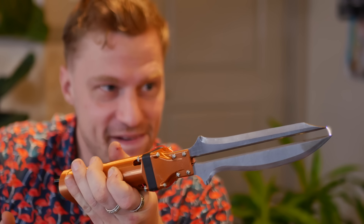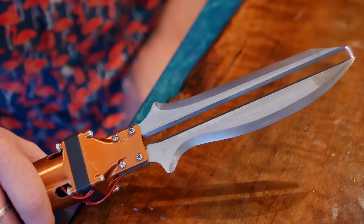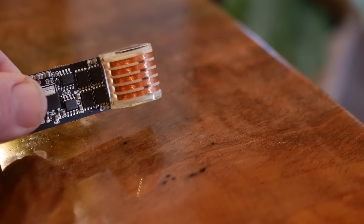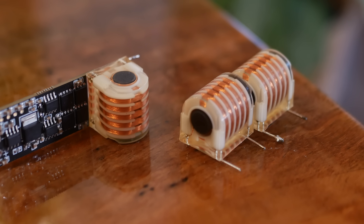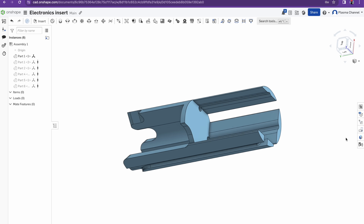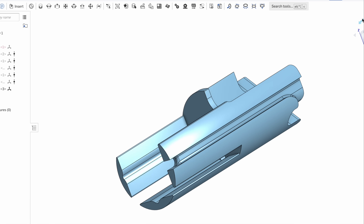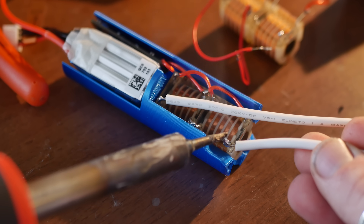I have a little bit of an issue of it forming an arc at the end, but essentially it works. It's a little underpowered, but I think I can fix that. These boards come with one transformer attached — adding a second transformer allows for double voltage. Space was already tight, so I designed an electronics insert to maximize all remaining space and insulate everything from the insane voltages this would produce. Wiring the transformers in series-parallel configuration allowed for that double voltage.